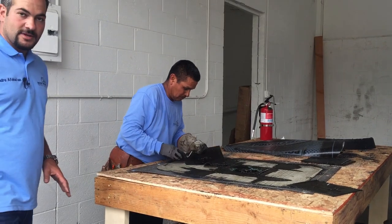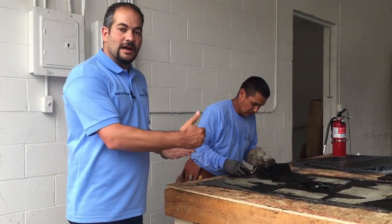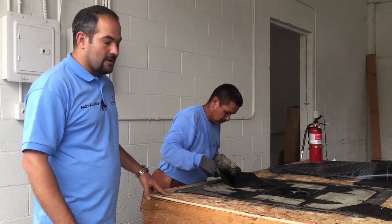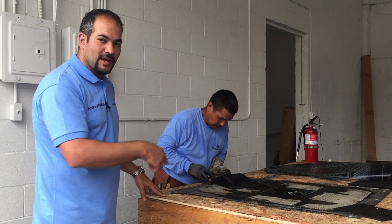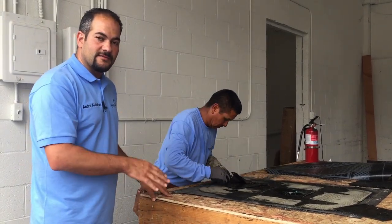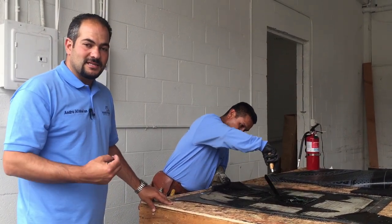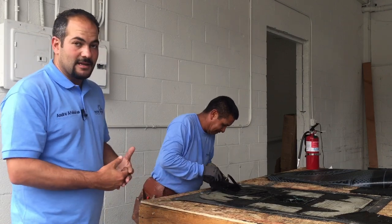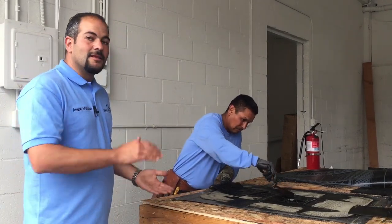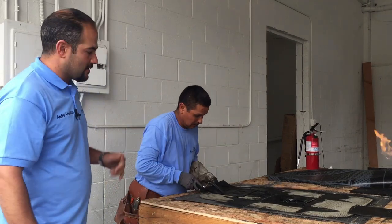Jose has finished doing all four sides, sealing them with the molten tar. What he's doing now is melting some more tar and priming the inside of the drain. That's going to ensure proper adhesion when we do the final layer of torch down. Since the cast iron is a pre-painted surface, it's difficult to get good adhesion there. So he's melting the tar, applying a layer, and then when we do the torch down we're going to get a nice bond between that cast iron drain and our new torch down.